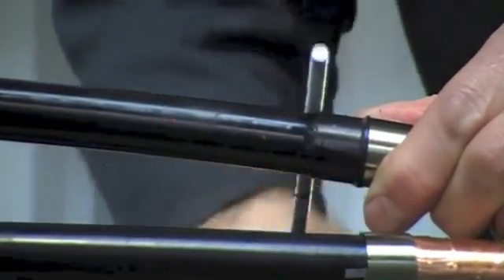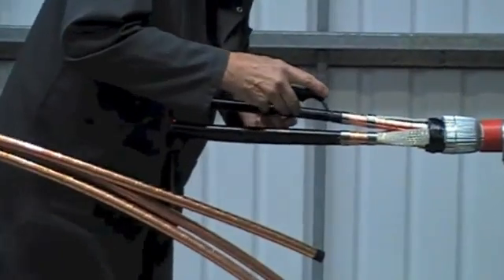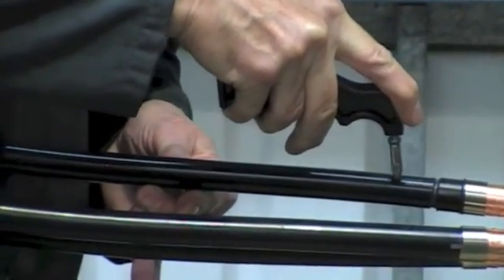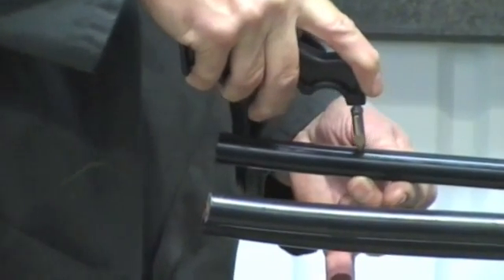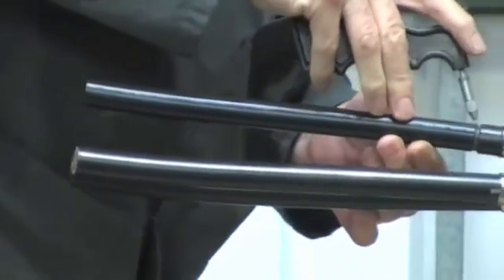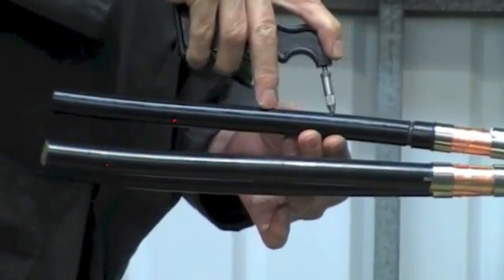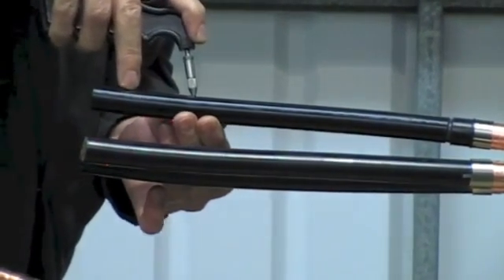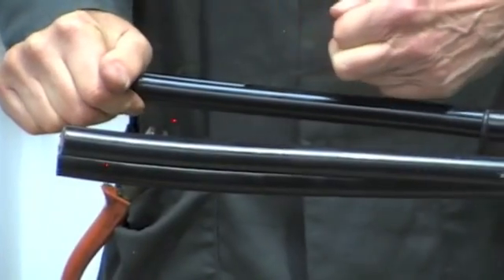Do not use a sharp knife or a Stanley knife to do this. This is a very critical point of the joint installation. Scoring tools are available with a blade set at 0.4mm so it doesn't score the core beneath. Make three or four tram lines down the length of the core to make it easier to remove. There is no need to use glass to do this.